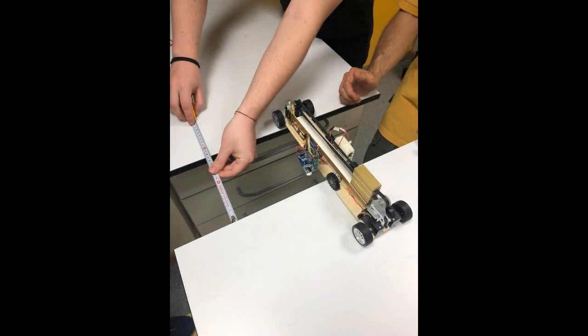Our designed robot's purpose is to complete a path with obstacles. In this project, the obstacles are gaps on the road. In order to achieve this purpose, the robot is designed to change its center of mass. By changing the location of the center of mass, we are always able to keep it on mechanical support and prevent the robot from falling into the gaps.